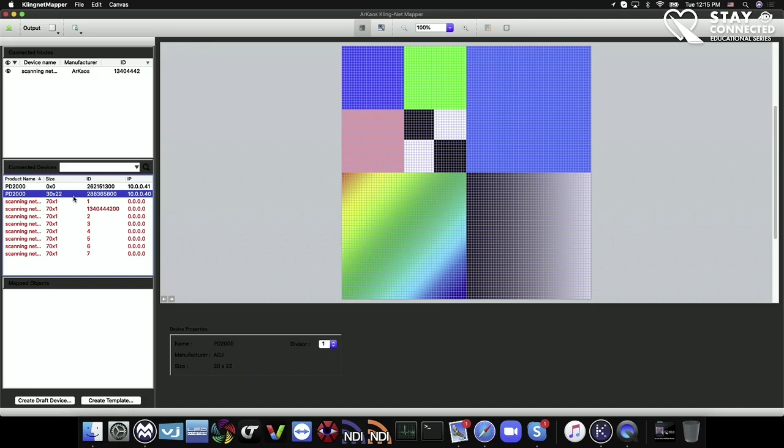Obviously, we don't have 30 of the Pixie Strip 30s connected. We have a various number of units, but as you can see, it's identifying 22 of them. What that's doing is pretty much just splitting our Pixie Strip 60s that are on the line in half, and the Pixie Strip 120s that are in the line into 4, sections of 4, should I say.